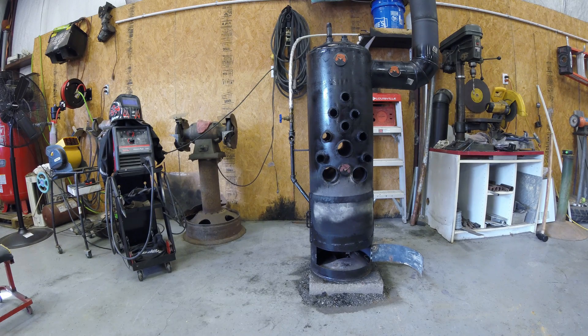The heat exchanger pipes work great when I put the squirrel cage fan behind them. The heater is just performing beyond anything I could ever imagine. The smoke that's coming off of it now is because I put some paint on it — header paint. It'll burn off over time. I thought the header paint might stay, but you can see it's already cooking it off, turning it white. That's vegetable oil in my waste oil heater with modifications — waste oil heater version 3.0.